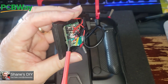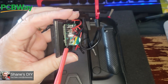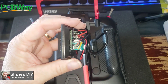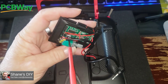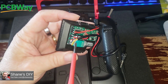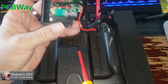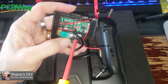That's this little board here, and all it needs is power. This will take up to 6 volts input. The problem with using the battery directly was that it goes up to over 8 volts when fully charged, and even at low it's not below 6 volts. So this can only take up to 6 volts — and the capacitor on it, I believe it's rated at 6.3 volts — so if you get above 6 volts you're risking blowing up that capacitor. Since I wanted to keep it all self-contained in this module bay, I needed to drop that 8 volts down to the usable 5 volts that the amplifier needs. That's what this other little secondary board is.